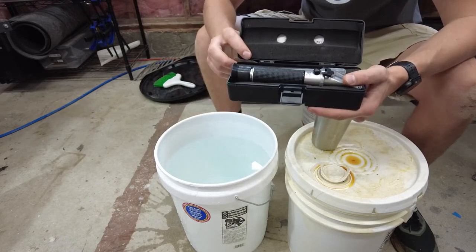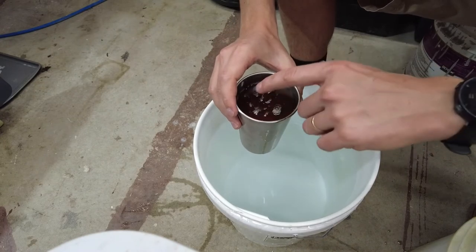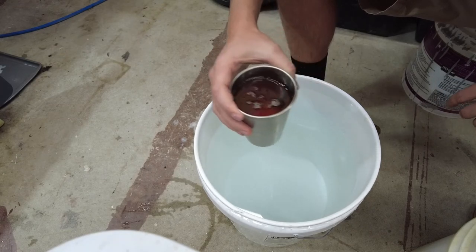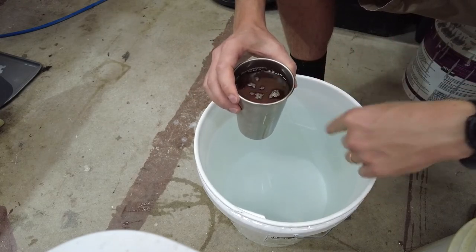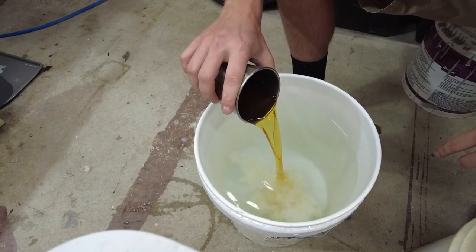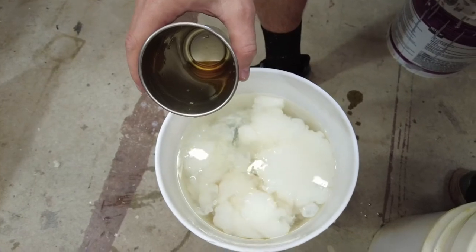I'm going to roughly get close — this is probably about a 12-ounce cup, so probably about three and a half of these cups I'm going to pour in. I'm going to emulsify it — which means stir it really well — and then check it with the refractometer and try to get 8%. If you thought the first time you ever saw coolant oil, 'why is it brown? Why does it look like the latest greatest IPA out of the Pacific Northwest?' — when you pour this brown oil into the water, it turns white instantly, which is kind of cool.